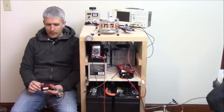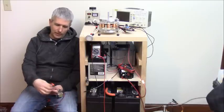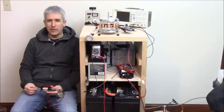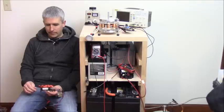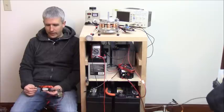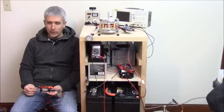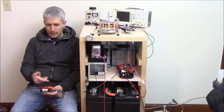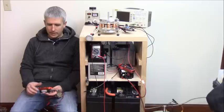Both Bedini and Newman wrapped the coil all the way around, on either side of the shaft. It was not really practical, so I always ran it this way. You have north-south facing magnets, and either coil side will be directly over top of opposite magnets, because you have a spinning taking place like this that rotates, and that's the motor side.